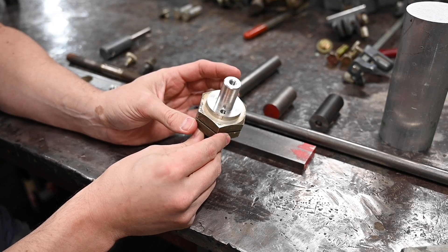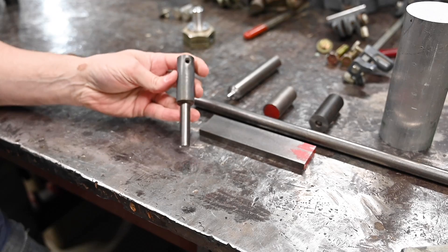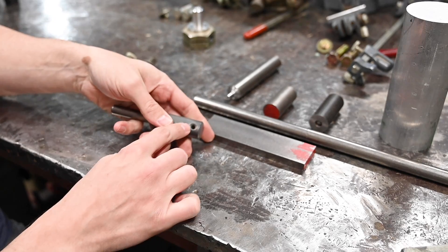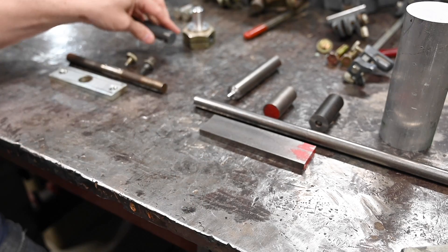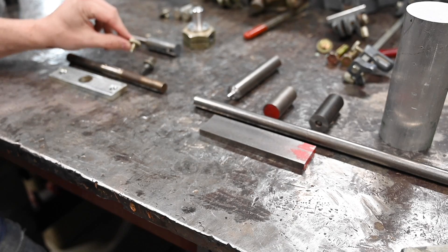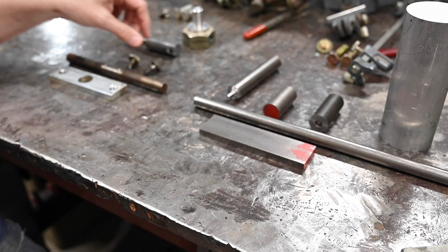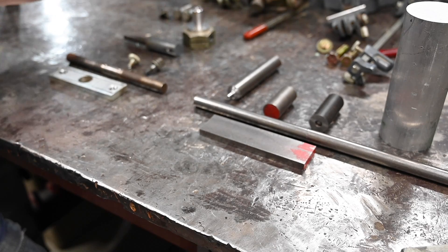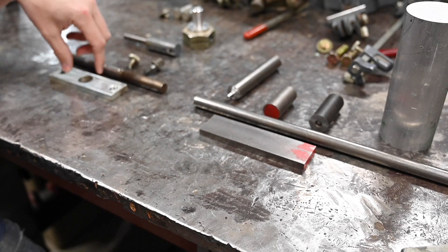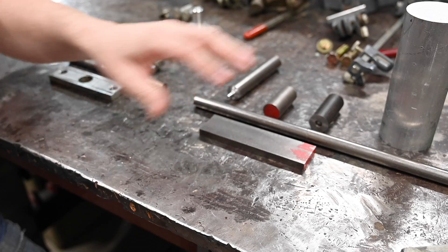That's going to be the most difficult one to make, but still not that hard. I've also got to make a bar for the diamond dresser where the diamond goes in, and I need a couple of thumb wheel screws — probably just one is enough — plus this little custom hex stud, and a shaft that the whole assembly rides on with a mounting plate.